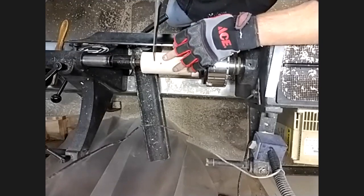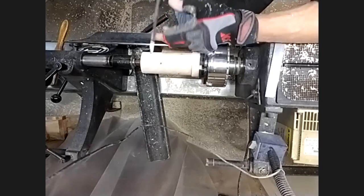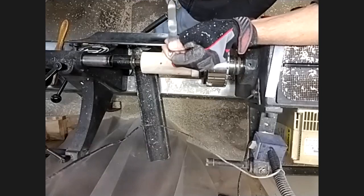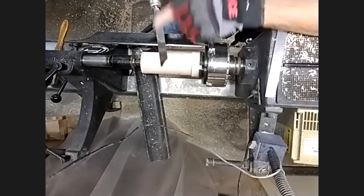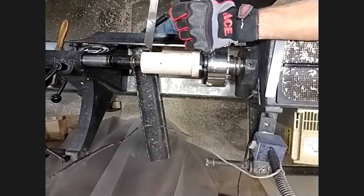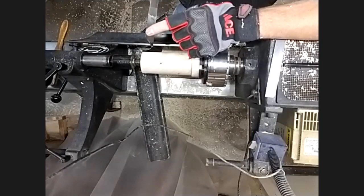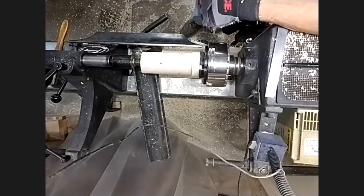So in this particular instance, we don't want to make a relief cut when we're going in and making this cut. So similar to sharpening and prepping your scrapers, I believe Scott Hampton covered this on one of his sharpening demos. You want to flatten the sides of your parting tool. That'll prevent a lot of the catches and a lot of the wood burn that will get carried back onto the actual parting tool here.